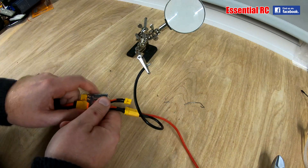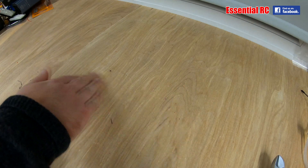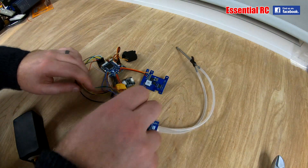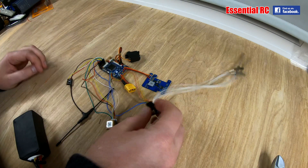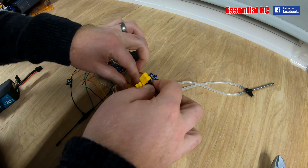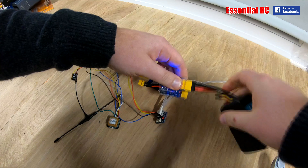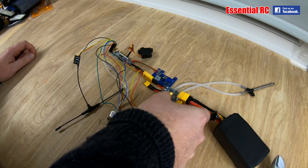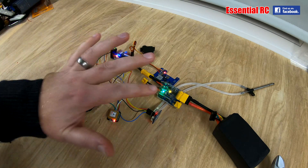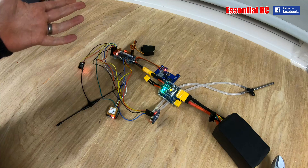It's also quite handy when you're building a new setup, because one nice feature is you can use it as an on/off switch on a model that potentially doesn't have one. Here's a build I'm currently working on for an FPV model — lots of soldered joints as you can see — and I want to make sure everything I've soldered is correct. Instead of plugging the battery straight in, I put the little Short Saver in, connect my LiPo, and then turn it on. As we can see, everything's lit up — the controller, the BEC, etc. The device is happy: green, no faults. And I can turn it off and on again. So it's really handy for setting things up as well as protecting all your expensive electronics.